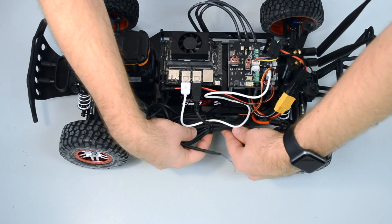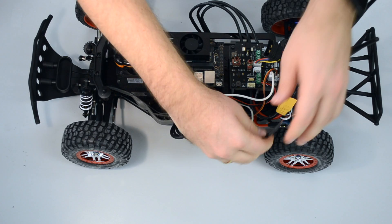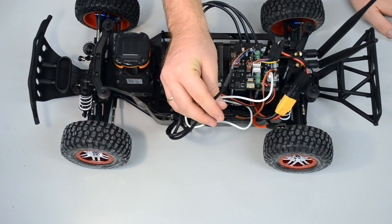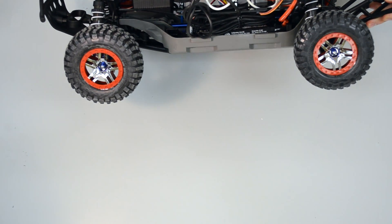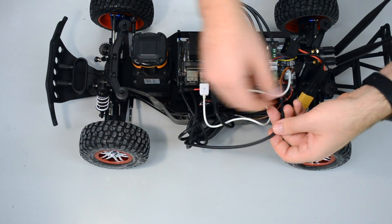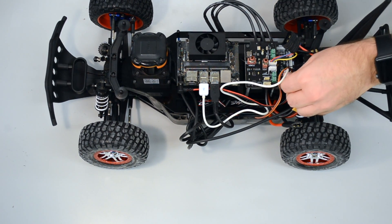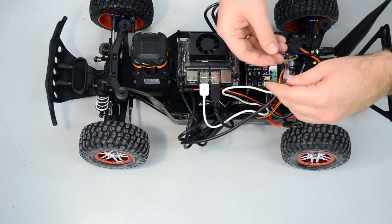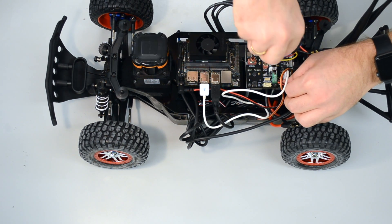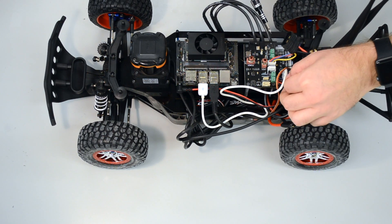Then, number two, try to store the cable a little bit more on the left side. Then it comes to part number three: the connection of the energy. The LiDAR has two connectors. Brown — you can see that on the left side of the LiDAR — means 12 voltage, and blue means zero voltage. We will use our power connector here and connect the 12 voltage with one of the greens first, then connect the zero voltage.